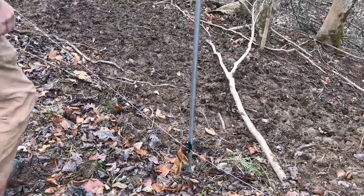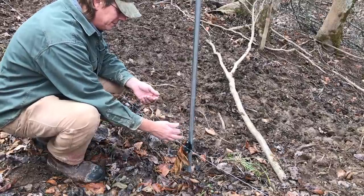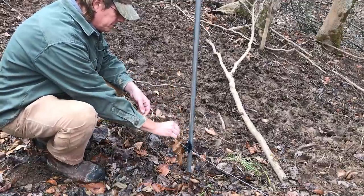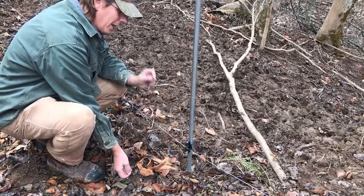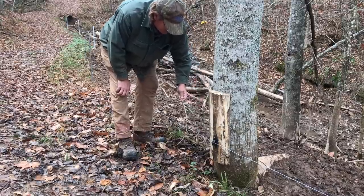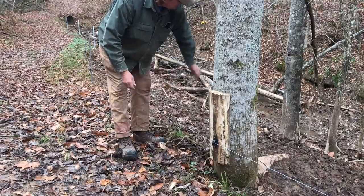Here's a second issue. Not a huge deal, and with a good energizer this won't make that much difference, but these add up over time. As we go around almost a quarter mile worth of fence, things like this can add up. This time of year all the leaves are falling — this is a hickory compound leaf that's just laid across the fence and is touching the ground. When it's dry not a big deal, but when it's wet that water makes a good conductor and grounds it out, losing some energy. We've also had a lot of wind, so here's a maple branch that's fallen and wedged itself against the fence.